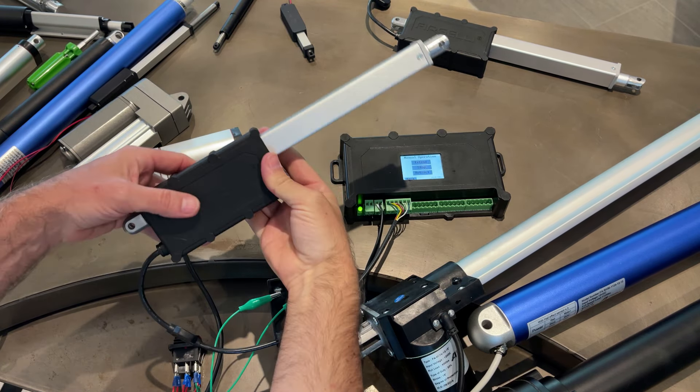Now we need to talk about running an actuator in terms of voltage and current, because it's very important. What does voltage do to an actuator when you run it at different voltages? Here we have it hooked up - set to 12 volts. These variable power supplies are extremely useful. Let's show what happens when you lower the voltage - now at five volts, see how it slows down. Speed is directly proportional to voltage.